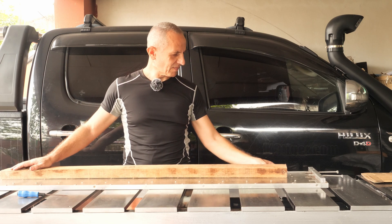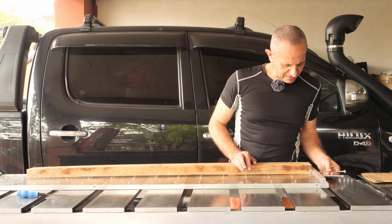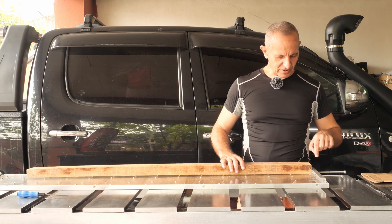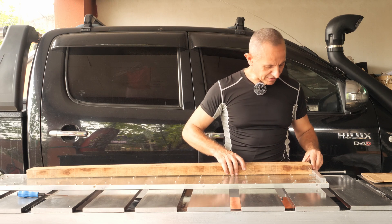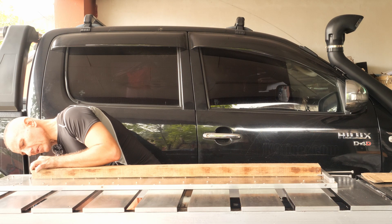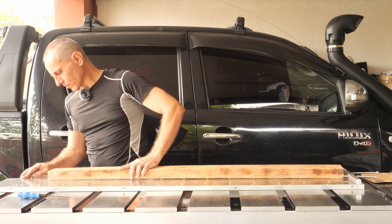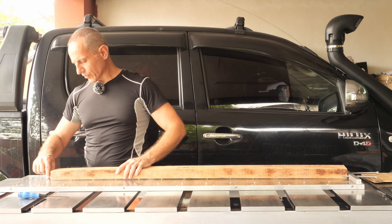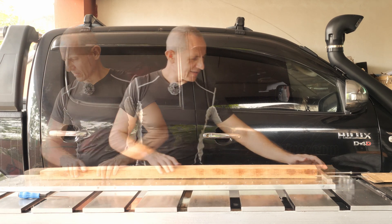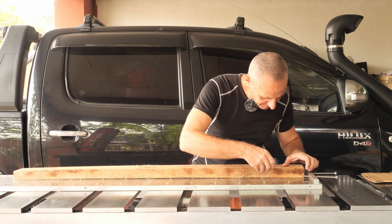The material will be resting on these two grab screws serving as the front stop block. The material will pull the sled along with it, so the back part doesn't do anything. For the clamp bolts I used stainless steel threaded inserts which are eight millimeters internal and 12 millimeters external thread. I'm making my grab screws stick out five to six millimeters. The material hits the two protruding grab screws ensuring the material will pull the sled along, and at the back I tighten the clamp bolt.